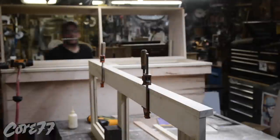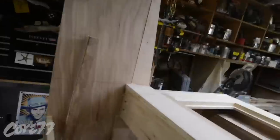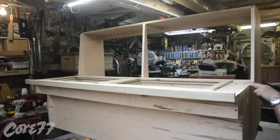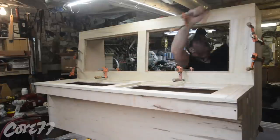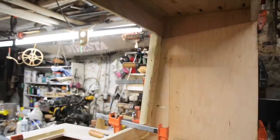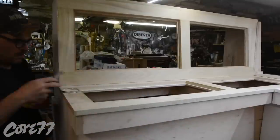That edge where the glue bottle is sitting sort of wraps the back edge of the seat, and there's my face frame for the seat. I had three face frames to make and didn't want to make the video too long by showing the process — they're all basically the same. I wanted to have hardwood edges facing out everywhere, so that's why I put that little cap at the top of this face frame that wraps the plywood. Again I'm adding some Kreg jig pocket holes where I know I'm going to be able to get the screw gun in there. I prep my face frame, tip it up, glue it into place — this is a big glue-up and I dry fit it a couple times. I let the glue dry for about 10 minutes, then start putting in pocket holes, and you can see how I have the frame going directly into the seat.